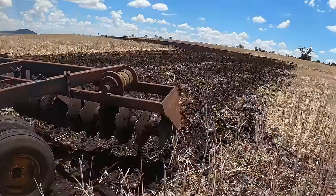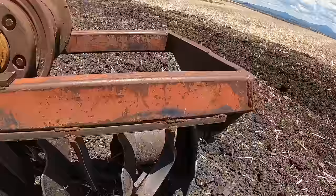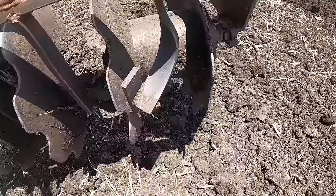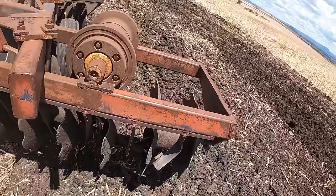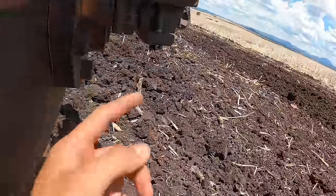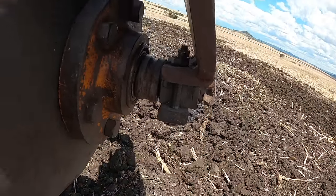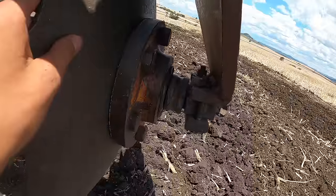After 3 hours in the 40 degree heat, we have it fixed. So you can see the damage with this mud scraper. It twisted and bent it in because it was rubbing on a bit. But Josiah came down and helped put this back on. What happened was, this whole gang came off its little slots here, and we found this little metal plate had come off its weld and bent outward, so this gang slipped out. So we re-welded that and fixed it up.